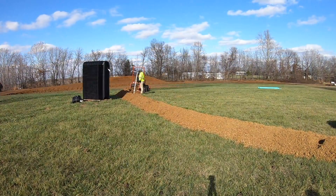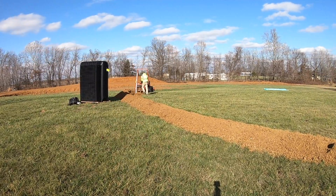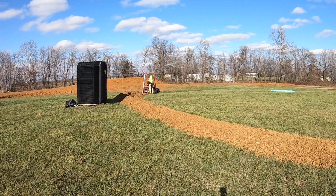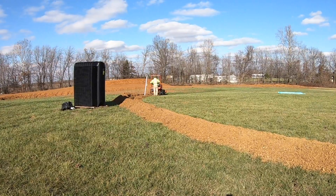This system here was 32 inches deep. You can see I'm checking it with a laser level as I go over a kind of hump or hill here, so I just needed to maintain that depth. That was specified by our county to be a certain depth lower than the chambers that we're going to install later.